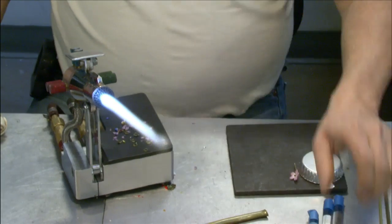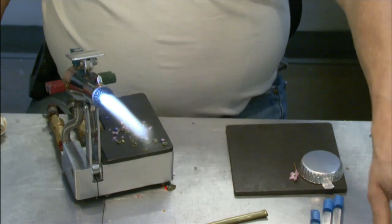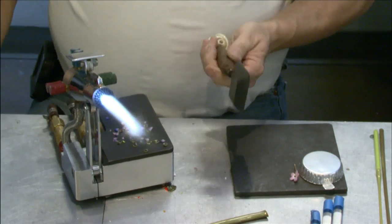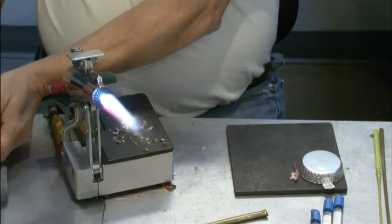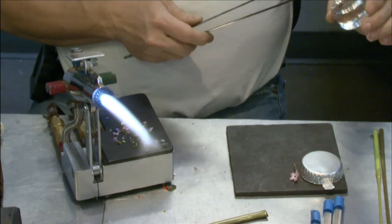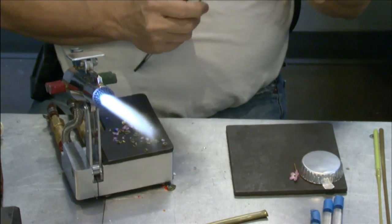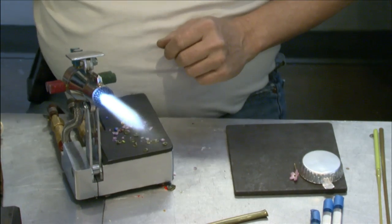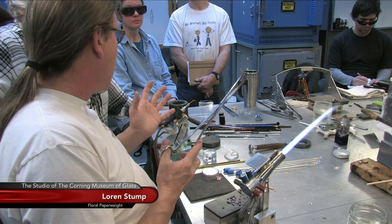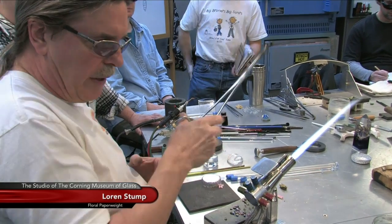Those are your puppies prepared. Now, I've got a ring mold here. This is for making the paperweight shape at the end. It could also be a marble or a sphere, as they call them these days. I need a graphite shaper, a brass shaper, and a pair of large tweezers for peeling the pup. Once these are puffy and picked up, we're going to peel the entire surface off of this pup, so it's absolutely clean and never been touched by dirty fingers. Hemostats, just in case something comes off with the puppy, which does happen, but hopefully it won't now. That's for picking things up or dropping on the table.